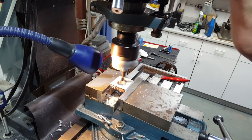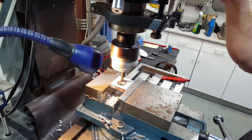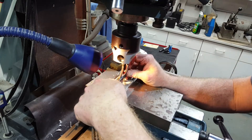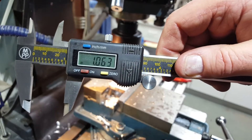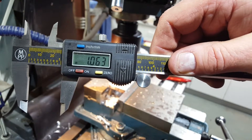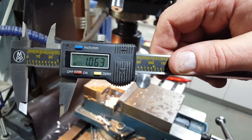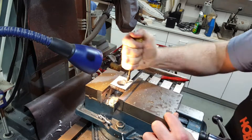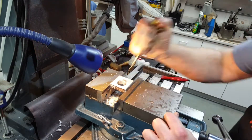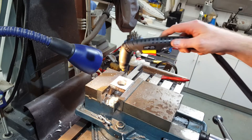I drilled a one inch hole through my aluminum plate and then with the boring bar, sized that hole out to about 1.063 inches. The body of my torch is about 1.060, so I just left a little bit of extra clearance so that it would fit into the clamp easily. Before breaking down the setup for boring the hole in the plate, I did a quick test fit with the plasma torch. It fit just fine.